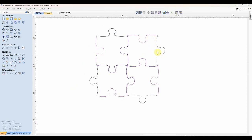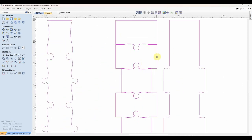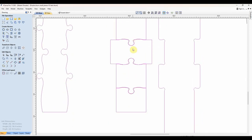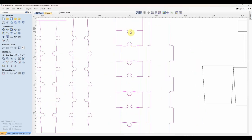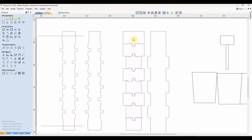I will basically be cutting out shapes that have the female on the up and down — the 90-degree angle — and then male on the 90-degree side. So I'll be cutting out pieces that look like these, flat on one side. Eventually I cut out the four-and-a-half-degree cut on those, but I can't do multiple different angles in one cut. So all these are 90 degrees, straight up and down, perpendicular. I'll cut all those pieces out — there'll be 40 strips like that. There'll be a jig you'll see later that I'm going to use to hold it in place while I'm cutting the angles. Once I have all these pieces cut out and glued together, then I'll cut the shape out on the sides, and that will give us our four sides of the puzzle piece.